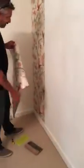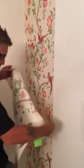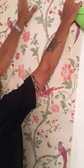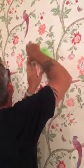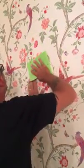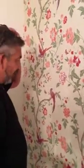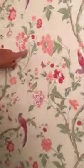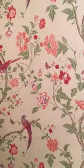Oh, yeah. So right, this is the next bit. I'll have glasses on so I can see. Now you're matching up the pattern and cut. Let that drop. Get the pattern as close as you can, and always do it above because the weight of the paper is going to slide down. Then nice and clean, and just put it in. Because it stretches and the way it's printed, eye level is best. You must get that spot on, eye level.